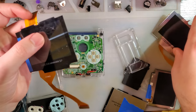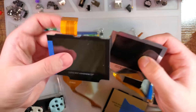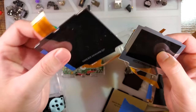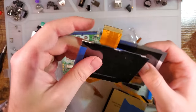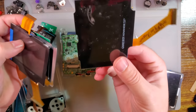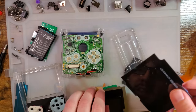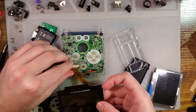So even though I think this would look better, I think we're going to go this route, because this should be a lot easier to install. And I'm probably not going to use this one, because I don't know that brightness controls work on this. And if I'm using a Game Boy Advance kit, I might as well use one with working brightness controls, as opposed to a Game Boy Advance SP kit, which doesn't fit. The ribbon is just, quite frankly, not long enough. If we put that in there...